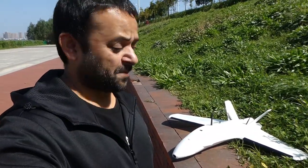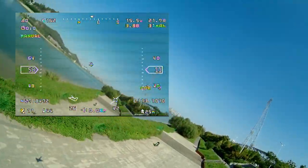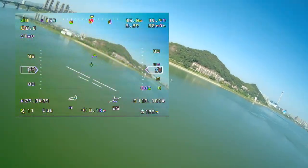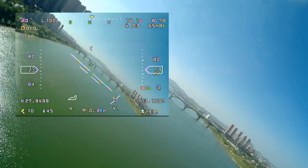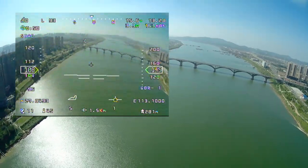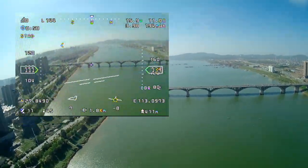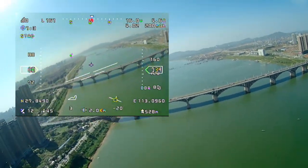How the FPV flight will go — I hope the S and L flight controller can handle those high speeds and I hope everything goes right. Welcome to the first flight — it's very windy today and I still have to test if the flight controller is going to cooperate. Let's test some cruising speeds and see how many amps my setup draws at different speeds. Keep an eye on speed — dial at left center and amps at top left corner of the screen. At 122 kilometers per hour the plane was drawing about 14 amps only, so I can cruise at 100 plus kilometers per hour and drain only 7 to 10 amps.